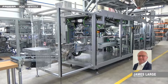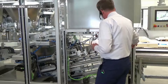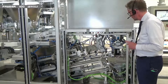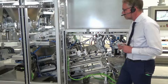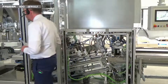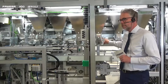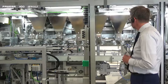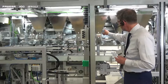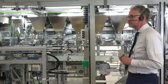At the far end of the machine, Mr. Barlandzifa is now pointing out the magazine area. This machine has a horizontal magazine and we will give you more detail about that later on. After the magazine we have the bag transfer area, and once we transfer the bags into the main part of the machine, you can see the travelling hoppers. One of the unique things about the FA438 is that it's a continuous motion machine. The more normal for this size range of bags is an intermittent motion machine, and there are a number of reasons for that which we can cover later.